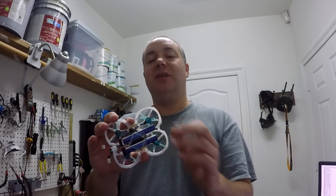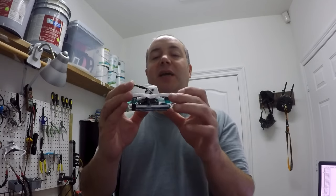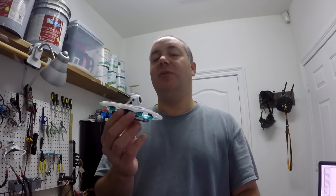You stick them on pencil lead and you slide them back and forth. The lead has very low friction, and then they'll just rotate down and you see which one's heavy and scrape some plastic off of them with the razor. So these are balanced, and with these on it, you'll see in the flight footage, it's pretty smooth. Smooth enough for me anyways.